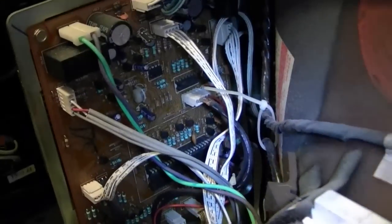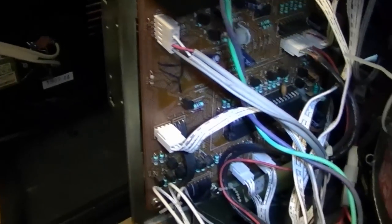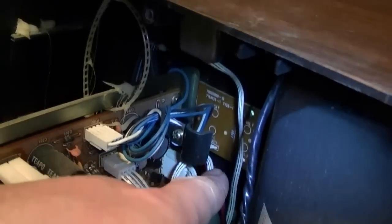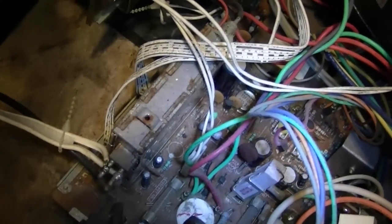There are two circuit boards. Obviously this is solid state — it even has a few integrated circuits, one big one down there and a few smaller ones. That might be for processing the infrared remote control signal. There's a little board up there with some controls on it, maybe the infrared receiver. There's a little transformer down in there; I'm guessing this set uses a voltage doubler or maybe a switching power supply for the power supply.